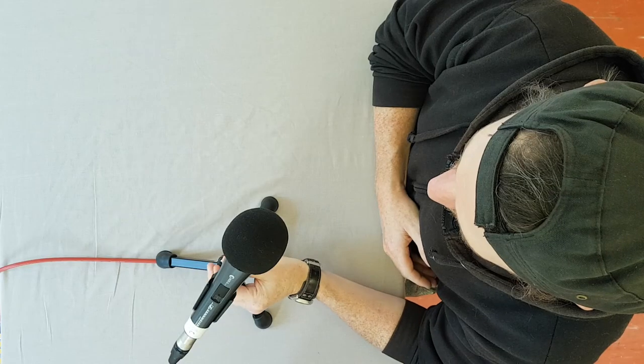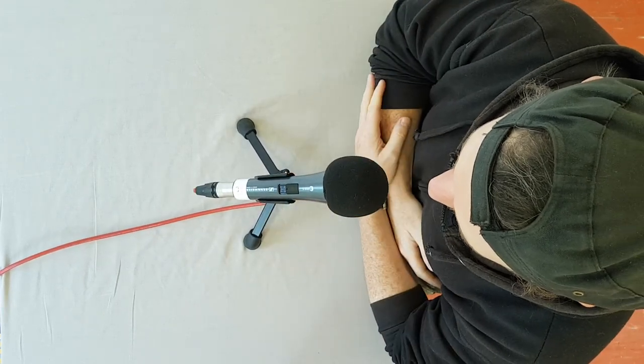This is a dynamic microphone. The same rules apply with this type of microphone as with all the other devices — the magic hand span measurement can be handy, and make sure you're facing towards the mic and not off at an angle. Feel free to experiment with your distance from the mic to get the best sound for your own voice. The closer to the mic you are, the thicker and warmer it will sound — more low-end. This is called the proximity effect, and BBC presenters and film trailer voiceover artists use this to great effect: 'In a world...' — that's proximity effect. The further away you are, the clearer and more even your voice will sound, but more ambient sound will leak in. It's a balancing act, so try it for yourself.